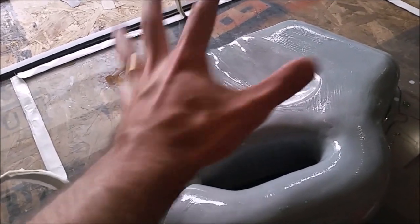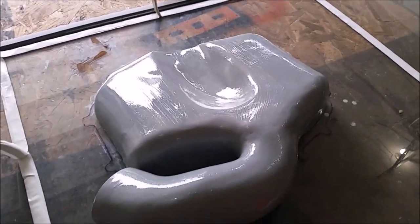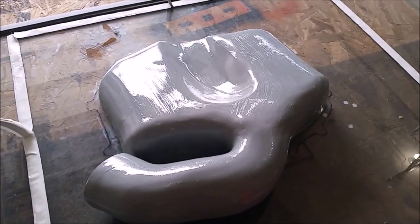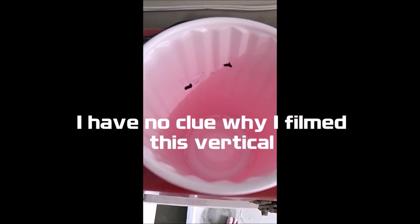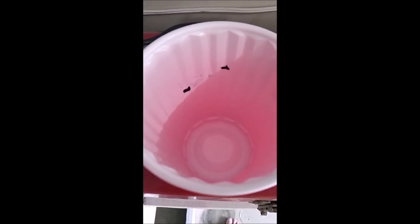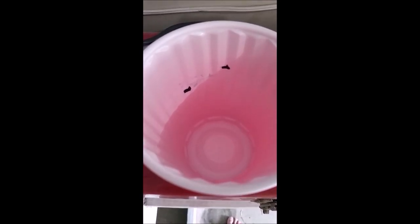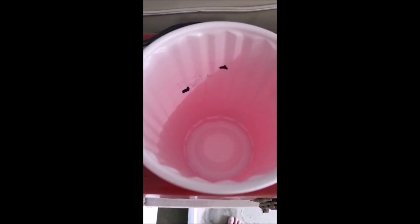This main section I think is just going to pop out in one piece pretty easily. I'm going to do one more coat of PVA, mix up all of our resin, and we'll get started. One easy way to measure out the resin is to measure it out with water first using cooking measuring cups. I filled in one cup of water and drew the bottom line, then a third of a cup for the second line, because my resin is a 3-to-1 mixing ratio. Just wipe the cup out, get rid of all the water, and you'll have the exact amount every time.